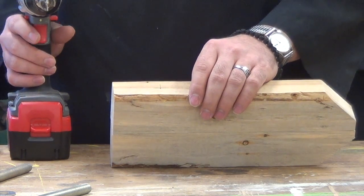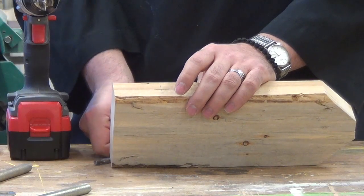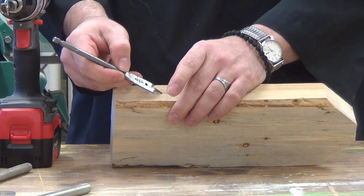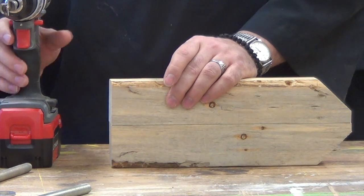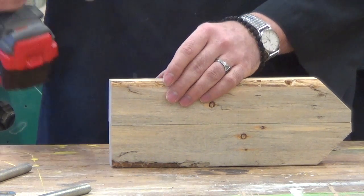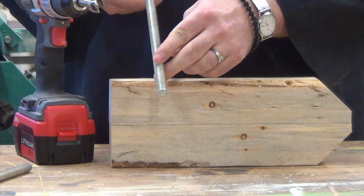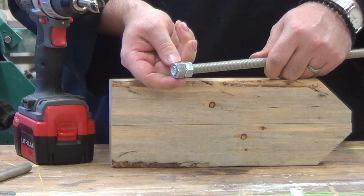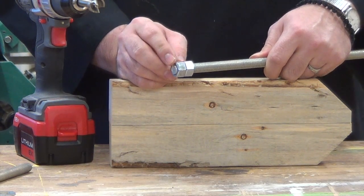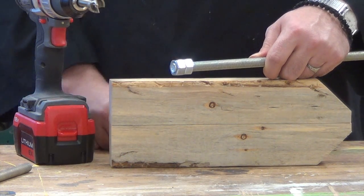One of the things you want to do is make sure that the nip of the bit fits directly in your crosshairs, whether you're using a paddle bit or a Forstner bit. It's also important that we keep the drill as close as we can to a 90-degree angle as we're drilling. I'm starting out with a three-quarter inch bit. The rods we're going to be using are half-inch rods, but we need to inset a bolt into the top — the bolt is just a little bit bigger than three quarters of an inch — and we'll seat it down into the wood with a little force and then keep it there with some epoxy.